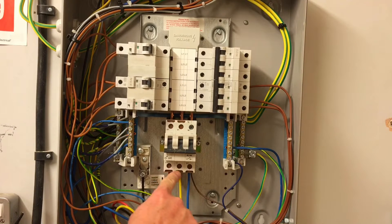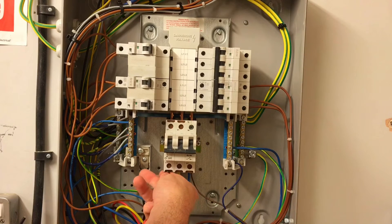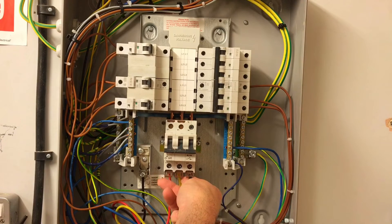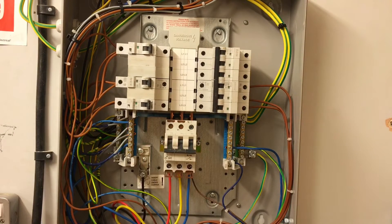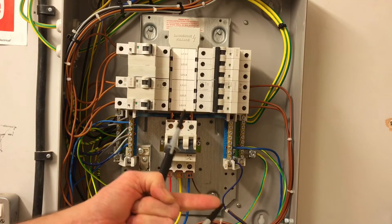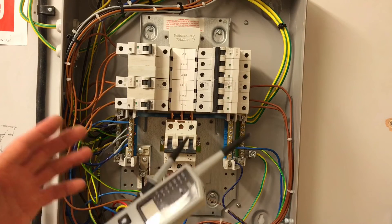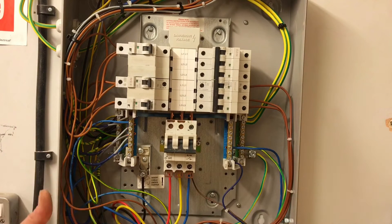The caps at the bottom are still in place so I can't touch the live parts — but I'm going to need to move those out of the way before starting. Depending on which documentation you're reading, the order of the 10 tests can vary. Net Services documentation starts between two lines — effectively a 400-volt test first. I do it in a slightly different order, because if the circuit were live and I probe onto one line, the other tip goes live and becomes potentially dangerous.